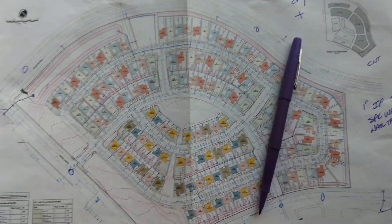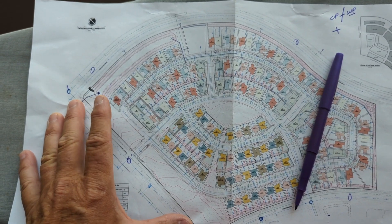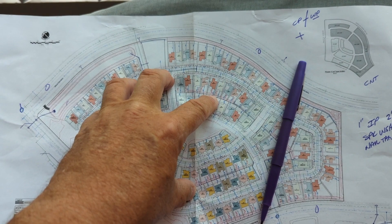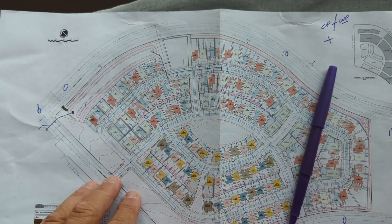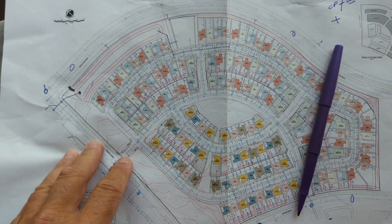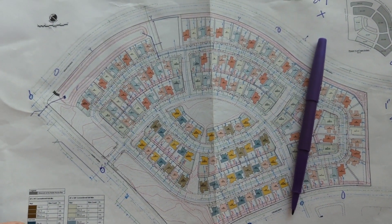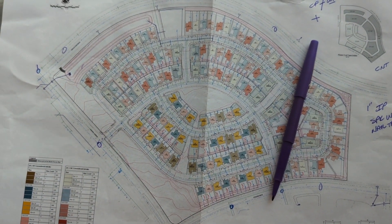Let me know if you have any more questions about control. That's how I handle it: primary control with the boundary and aerial targets; if you set them, control for the graders - all done by GPS. Then our first generation is as soon as they've got the pads built - recess them down, get all the underground done. As they start pouring curb or any fixed item, especially catch basins, start moving and throwing control points out. To me that's the chainman's job - as many control points as you can get, throw them all out. Survey out.